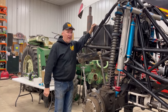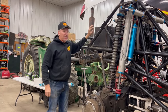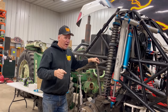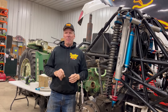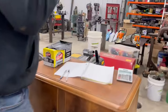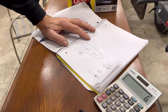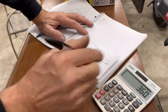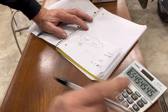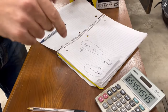Let's talk about fuel and what this power plant thrives on. 22-gallon methanol tank, 99.9% clear methanol is what we burn. Just to give you an idea how thirsty this thing is — at idle it's like a water fountain, at full throttle it's like a water hose. People ask what miles per gallon this thing gets — trust me, it ain't miles per gallon. This thing takes six gallons per minute. Six gallons per minute times 60 minutes is 360 gallons per hour. Divided by 55 miles per hour — that's 6.54 gallons per mile, not miles per gallon. That's how thirsty this bad boy is.